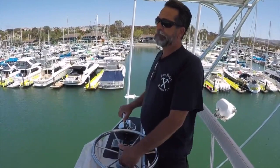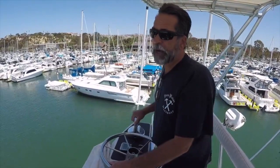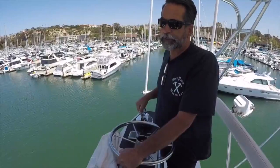The key to docking your boat is to go as slow as you can and still make way — meaning the boat's still moving forward or backwards. You're never ever going to want to use your throttle, because what you'll learn the hard way is that's when things break. That's when you hit things super hard and break things. We're going to show you exactly how to do it as smooth and calmly as possible.